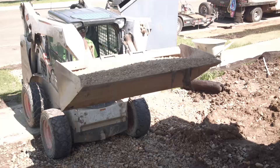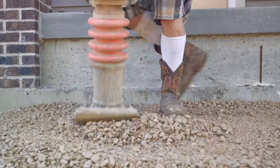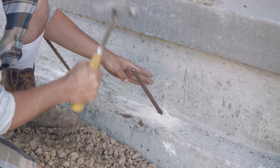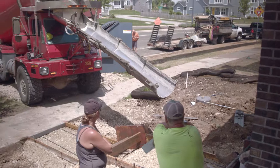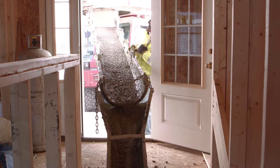Grading or placing of gravel to correct height, we should achieve four inches of concrete thickness. Then, if there is no exposed concrete wall at the house side, it'll be underpinned with number four rebar for support. And with that, it's time to step back — not that your work is over. Take this time to prep work steps for tomorrow's pouring of concrete. Basement, garage, and stoop concrete pour.